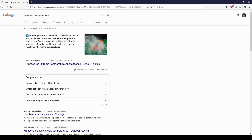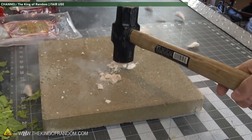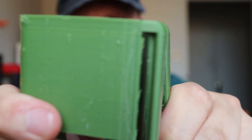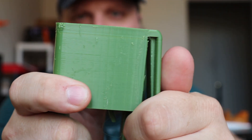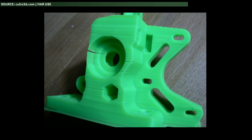The concern is when you mix plastic with sub-zero temperatures, you get changes on the molecular level that make plastic much more brittle. Remember what liquid nitrogen does to stuff? Same concept, just not as extreme. Tools and gear that would normally have more flex under stress suddenly get a lot more rigid and actually run the risk of shattering from applied forces. This applies to any plastic part, 3D printed or otherwise, but with 3D printed stuff it gives it a weak point along the layer lines.